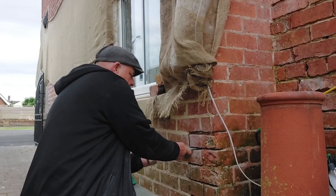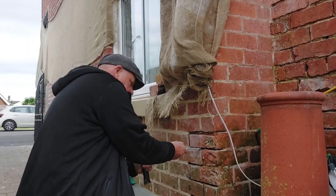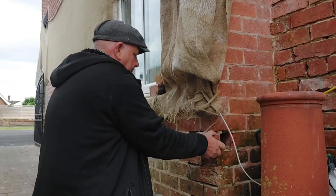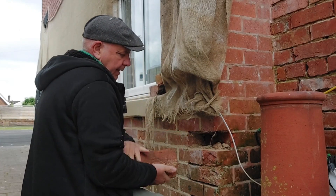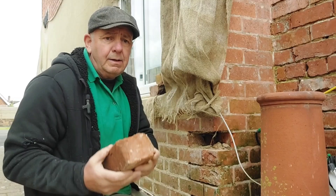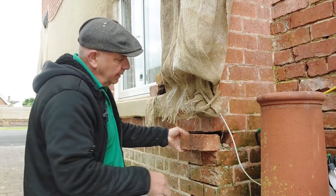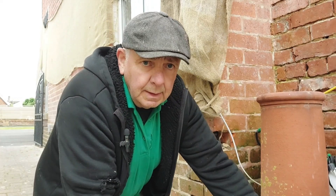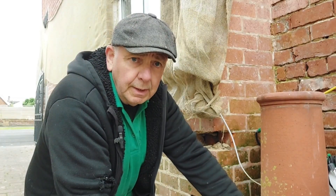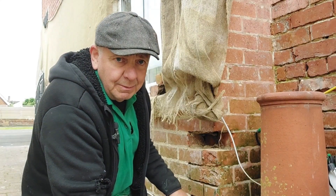Now what we do is give it all a good cleaning out, making sure we've got all that mortar out of there to the back of the brick. And there we go — you can see that brick can now be reversed. We put it in that way, so we've got the nice faces there. We know that's an original brick to the building from 1864, so we're not using a modern brick. You can't always do this, but 90% of the time if you're careful you can.